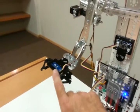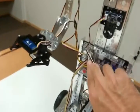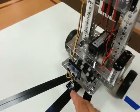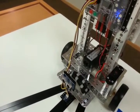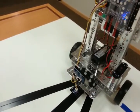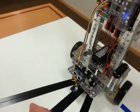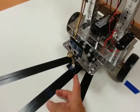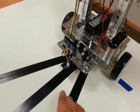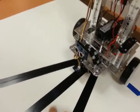The color sensor, which is over the gripper, is an I2C sensor, and we've connected it to the I2C port on Prism, which is right here. The other two sensors are digital sensors. This is an ultrasonic sensor, meaning it sends out a sonar beam that is reflected back, so it can sense obstacles in its path. This one down here is a line finder sensor, and it can tell the difference between a reflective and a non-reflective surface, so we're going to use this sensor to follow a line.